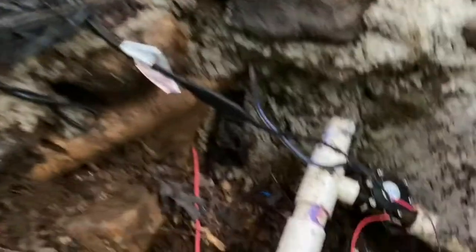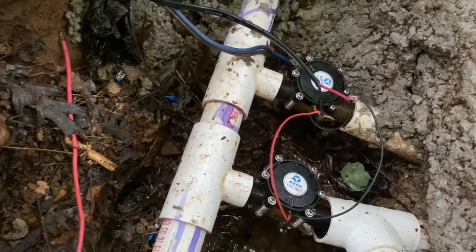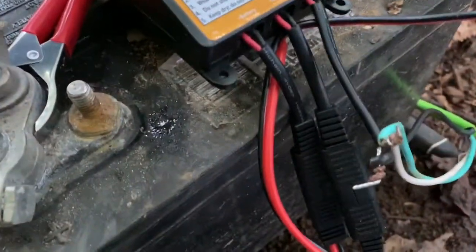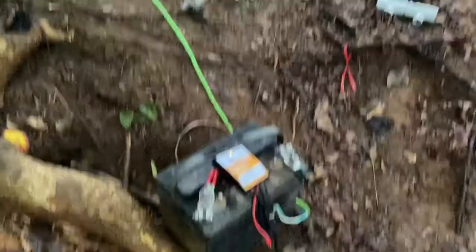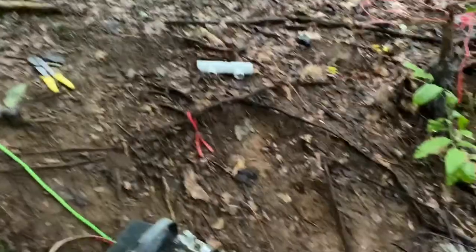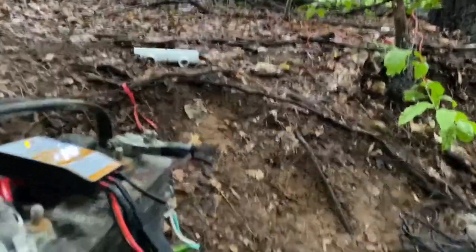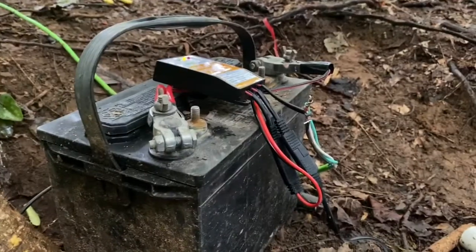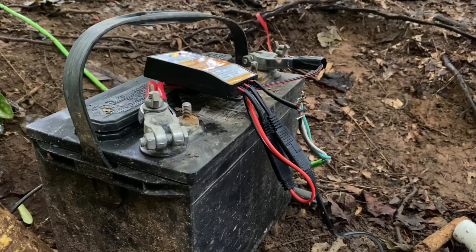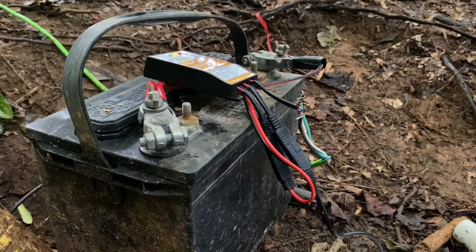So you can see we're taking hydroelectric power right here and feeding the battery. I have output power right here and I plan to put good connections on everything tomorrow. Let's take the Fluke meter and do some test readings to see what we have coming in to the charge controller. I can wire these into series and get 24 volts, but I don't want to overload the charge controller.